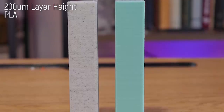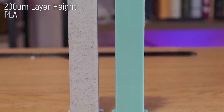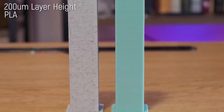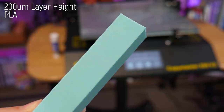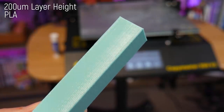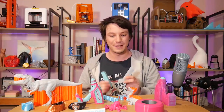Because it's a very large i3-style 3D printer, I did want to see if there's any gantry wobble as it moved up in the Z direction. So I printed two very boring columns. You can see that there is no wobble at all — the layer consistency is very good. You can even see where I changed the print speed on one of them because the plastic's glossiness changes, but the accuracy remains completely the same. On an i3-style printer, there is no perceivable Z wobble.